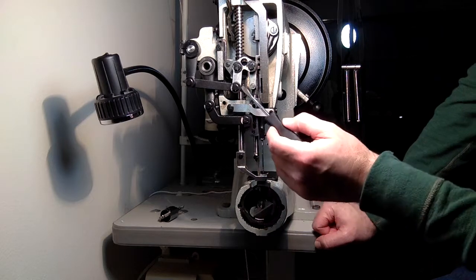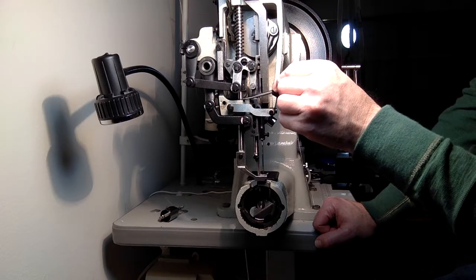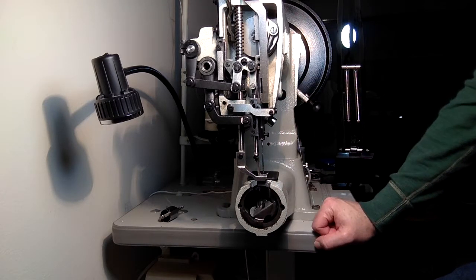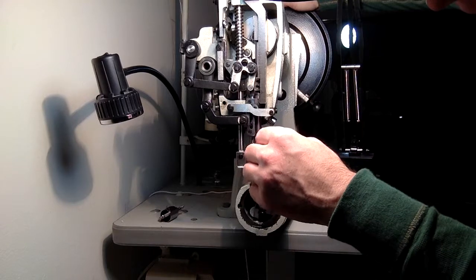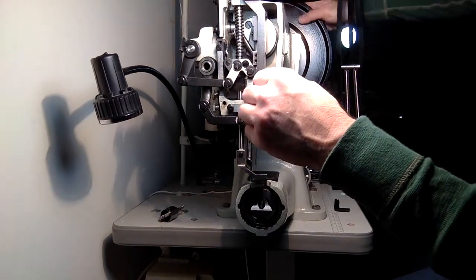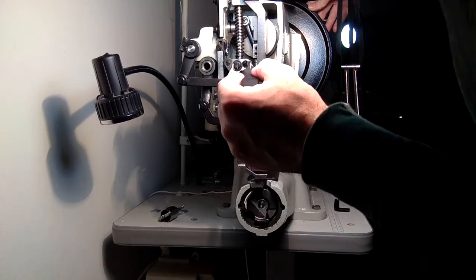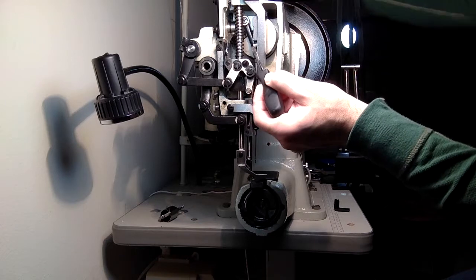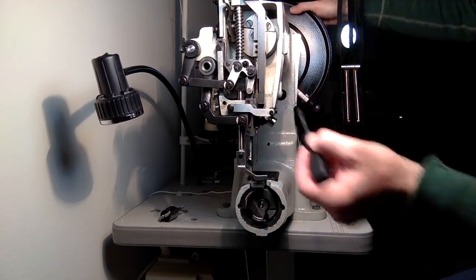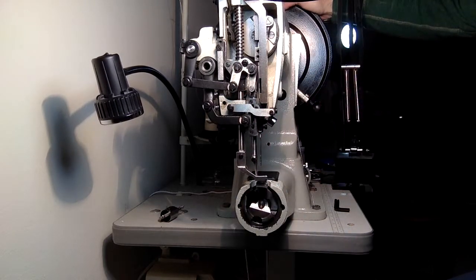The block here does not appear to have a bushing in it. The case, however, does have a bushing going through it. And the center presser foot going through this block also does not have a bushing on it. And if I get around here, this little block right here, I don't know if you can see it or not. It looks like you can. It also does not have a bushing on it. They all run just through whatever this cast material is right here, and goes from there.